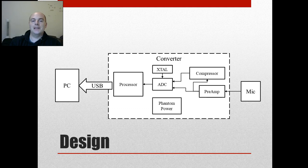The analog-to-digital converter's job is to take analog and turn it into digital, as the name says. It has a crystal or clock source to support that. Our microphone will go into a preamp, though we might change that topology — it might be part of the ADC or part of the compressor. The same source will go through the compressor and come into the ADC as a separate channel. So this is not a two-channel analog device — it's two channels of different representations of the same signal. That's our basic design, pretty straightforward.